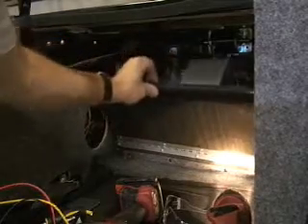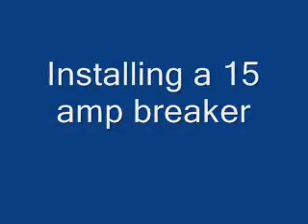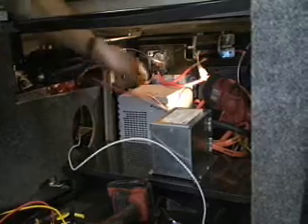Now I'm going to open up the door and come in the back here. I'm going to drop this down — these are going to be my other two wires, the other ends. Green's ground, yellow's positive. I've already added on to my ground wire; my ground wire goes to a ground bus clear back here in the back. The next thing I want to do — coming up underneath here — I have my bus bar and I've got to add in another breaker, a 15-amp breaker. I'm going to take these wires off of here and add that breaker in.